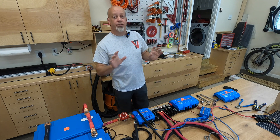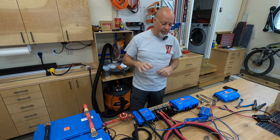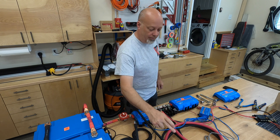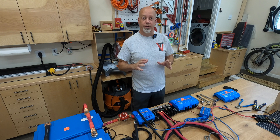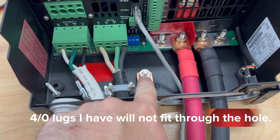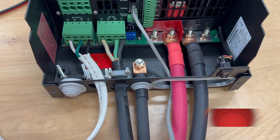As always, have your electrical diagram reviewed by an electrical engineer or your Victron distributor — that's how I had this mistake corrected. So again, 4-0 going in to the MultiPlus 2 means no less than a 2-0 for the case ground. Just as a mental note, I know that a 4-0 will not fit through that hole and hook onto the stud for the case ground in here.